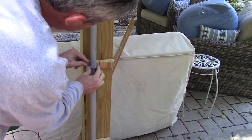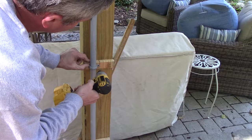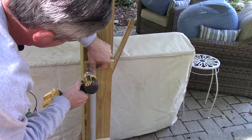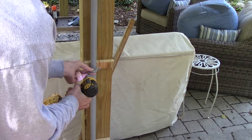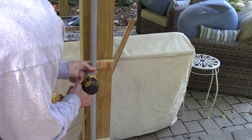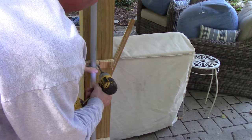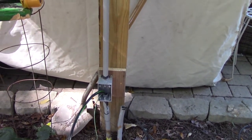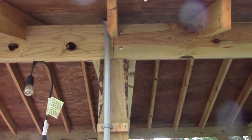These clamps — maybe we will clamp to that little spacer block. Based on previous experience, I'm going to pre-drill. I will run the cable. I probably won't use a box — I'll just put a coupling and run another piece of pipe up and run it in the other side. I think next we'll go to the house side and work on that.